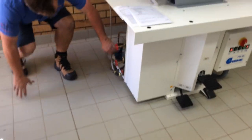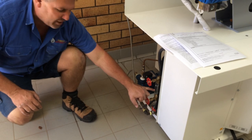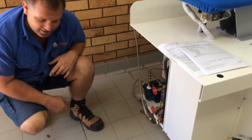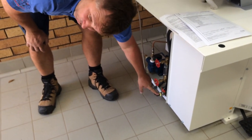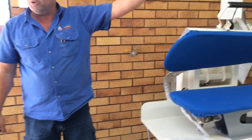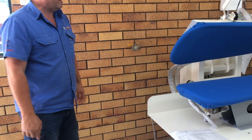You'll be able to see via this gauge when it gets up to that first little black bar, which is one bar of steam pressure. There's also a sight gauge here where you can see the water level. Sometimes it will get a brown or dirty looking colour in there, meaning we definitely need to flush that tank. Once we get up to one bar of pressure, we'll open up this tap - these pipes will get hot when you open it - and the water will go out to the drain installed outside.